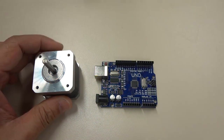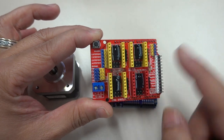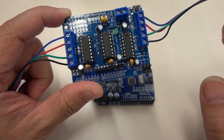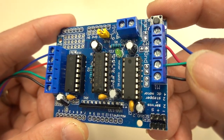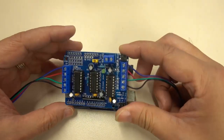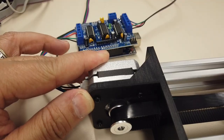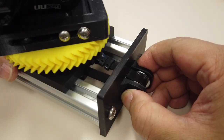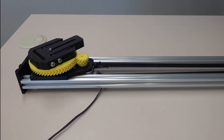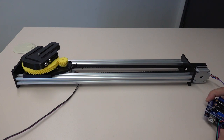The hardware is ready. Now I need to think about how to control the motors with Arduino. The CNC shield used when making the mecanum car can control four stepper motors, but we only need to control two stepper motors this time. So we used the AF motor shield from mecanum car 3.0. This shield can control four DC motors but can also control two stepper motors. One motor is installed on the bracket, responsible for driving the belt. The other is responsible for turning the gear to drive the camera. I wrote a simple program for Arduino to let the two motors complete rotation simultaneously.